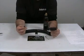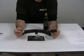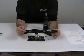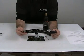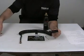The air leak can likely occur from two places. One is the quick release valve. If it's occurring from the quick release valve, it's likely due to a damaged or missing o-ring inside. There's a little black o-ring — this is what it looks like.